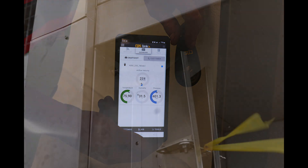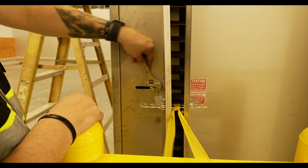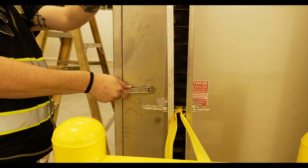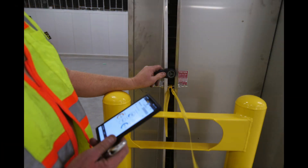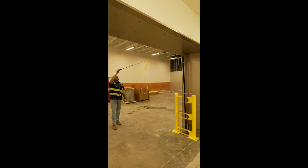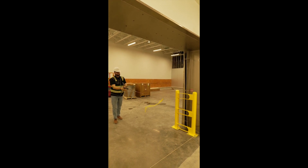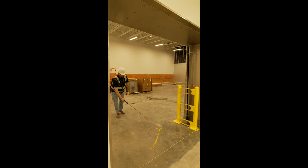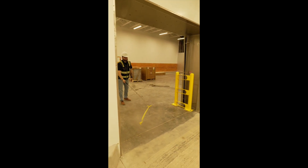If the airflow is too low on the top or bottom, open the slide blade up. If it is too high on either top or bottom, close off the slide blade as shown here. These readings were captured with a digital airflow meter. Once nozzle adjustments and CFM are within manual specs, you can begin the ribbon test. The ideal setup is maximum angle with minimum velocity, allowing the air stream to just make it across to the intake plenum.